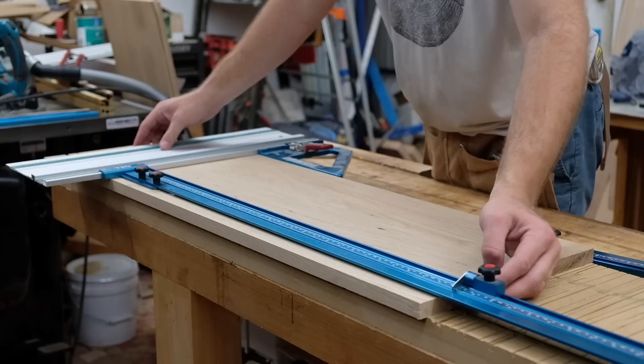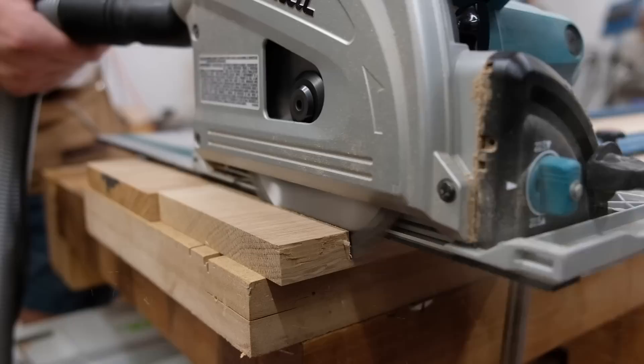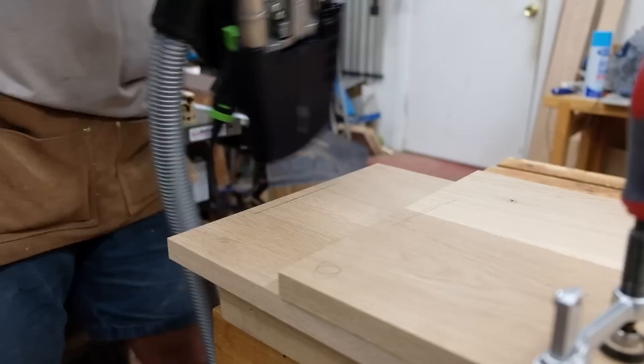I'm not sure this is more efficient than a crosscut sled, but it's easier for me to just move the track saw over these panels than to move the panels over the table saw. In this case I have the 50 inch rails, which allowed me to make all of the necessary cuts on these four panels. I used 6mm dominoes for the case joinery here, which seems to work out fine. I used 8mm on my last project and I think you can go either way with three quarter inch material.